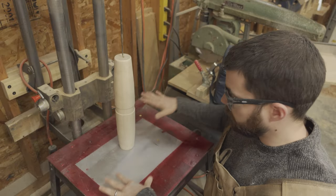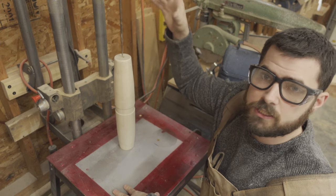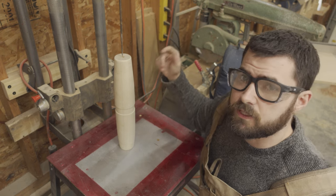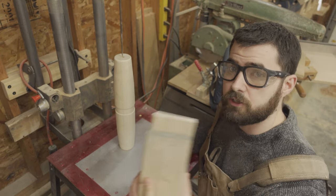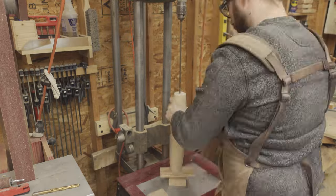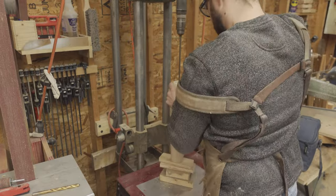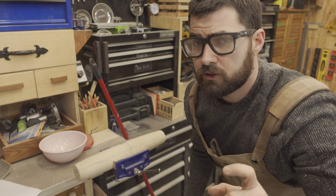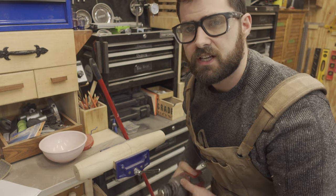To drill the final piece of the hole, I have completely removed the table from the Shopsmith, and I've just put this tool stand underneath it to act as a table. I can then drive the three-eighths spade bit the rest of the way through the piece. I will need to add some blocks to gain some height underneath this, because the Shopsmith does not have 16 inches of throw for the drill, so I'll have to continuously add little blocks underneath to basically give myself that height. That was very slow going, and the setup was kind of a pain to keep changing out just to get another three-quarters of an inch drilled through. So I have it all chalked up in a vise now, and I have just a hand drill — I'm going to just keep it as level as I can and power through.